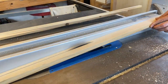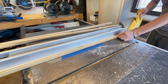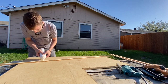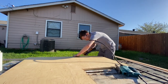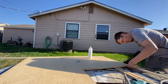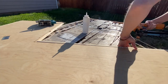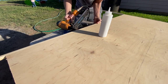To hide the layers of plywood I cut down some pine strips that will act as edge banding. There's actually a product made specifically for this but I don't have any in the shop, so these strips will do. Instead of measuring all of the places the strips would go, I just tagged them in with the nail gun and then cut them right in place — that eliminates any room for error.